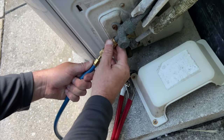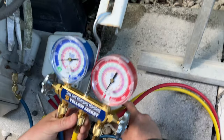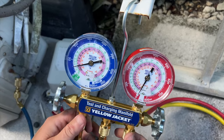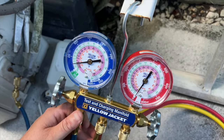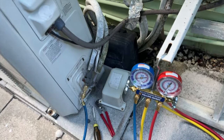This one here is where we put the new refrigerant. Oh, you're going to test it right now? Yeah, it's low — it's pretty low. It should be somewhere between probably 125 PSI and it's under 50. That's a big leak, man. That's not good. It's probably leaking from this coil — you can see how damaged it is.